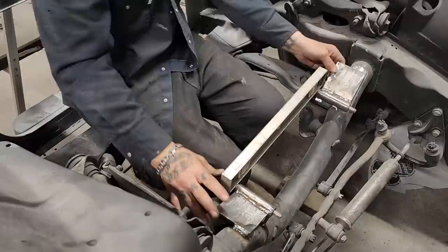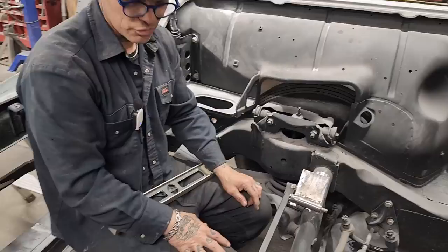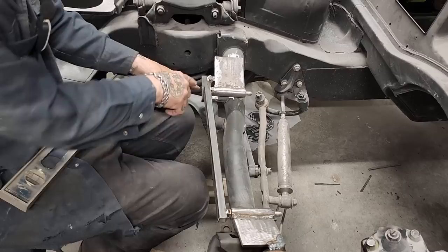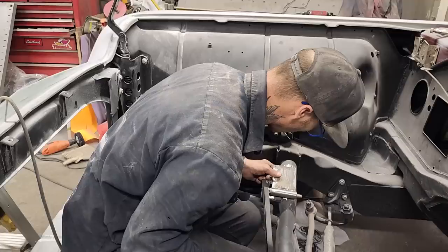Does it matter, like that bar that you have? Does it, because you've flipped it quite a few times? This piece? Yeah. Does it fit that mount on the floor the same way? It would fit the mount on the floor the same way, but this is what's going on. Joanie's asking me why I am flipping this piece and using it on this side and that side. This square stock, I've got welded on this one. It's short. The bolt is welded here, it's short. On this one here, it's welded on there, it's long. See how long it is there? What's happened is when I turn to the other side, this square stock is hitting on that mount, which is holding it up. So I flipped it over and have a shorter piece. Now it's not hitting. If I turned it over, it'd hit it again. It should give me the true read again, still exactly where I'm going here.